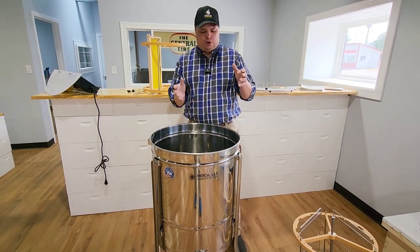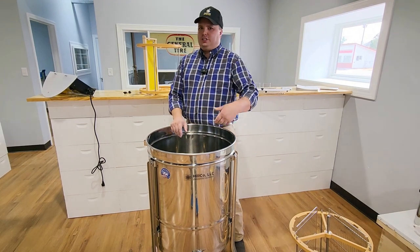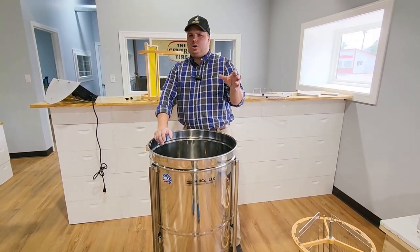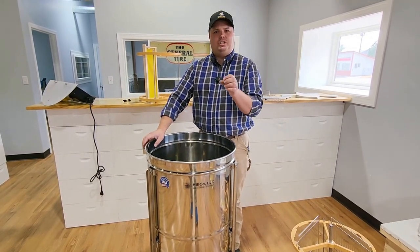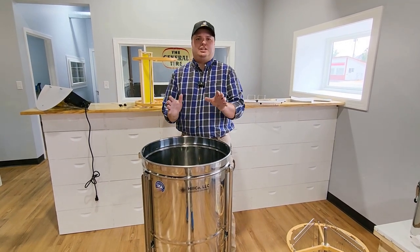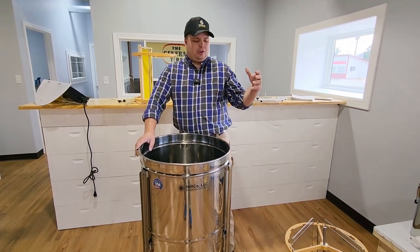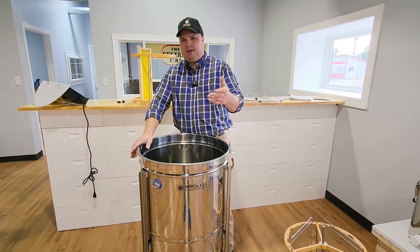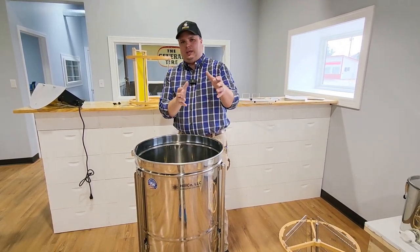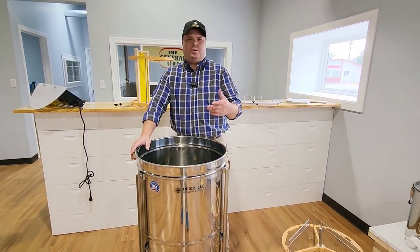As far as cleaning goes, personally I leave the machine all together and just garden hose it out for a while — put my garden hose on jet or high pressure setting and just stand there for a few minutes hosing it out. I recommend cold water because it helps harden up any bits of wax and break them off the reel so they fall out. We do recommend for your initial use that you disassemble like we've done, wash it out with dish detergent, and hand wash the tank. The machine is pre-greased, so you don't need to grease it until about every 10 hours of use, then once a year or every 10 hours after that, whichever comes first.